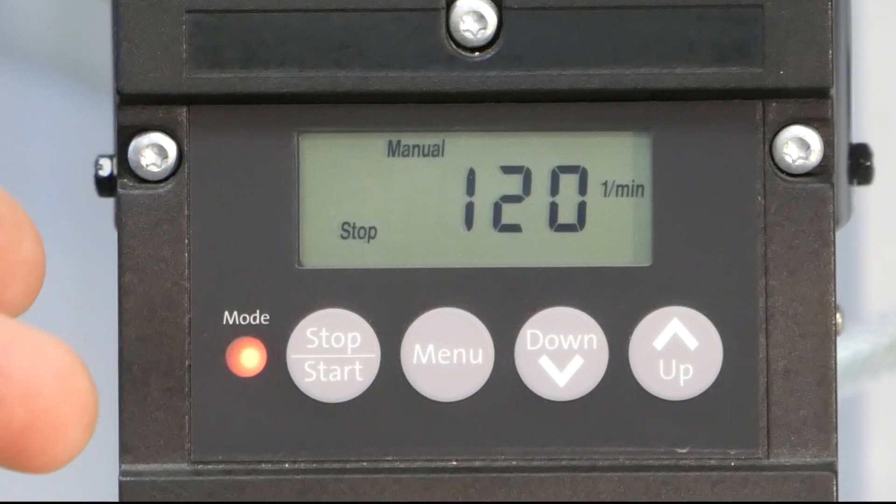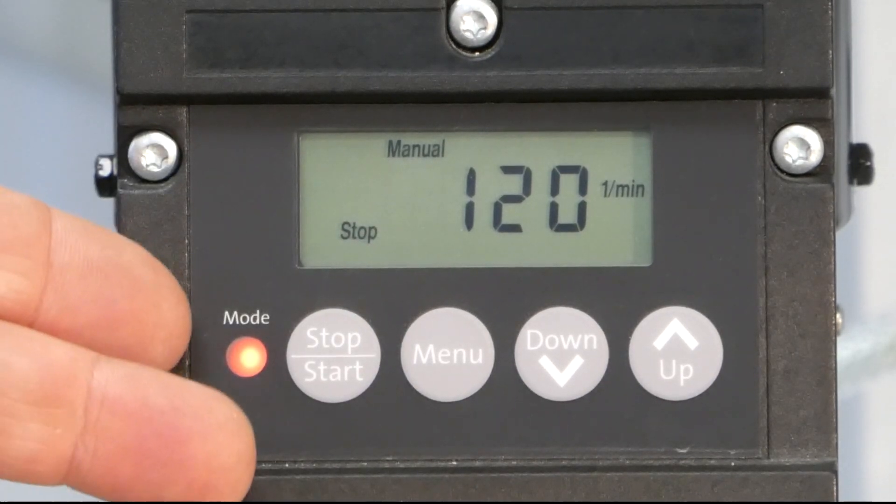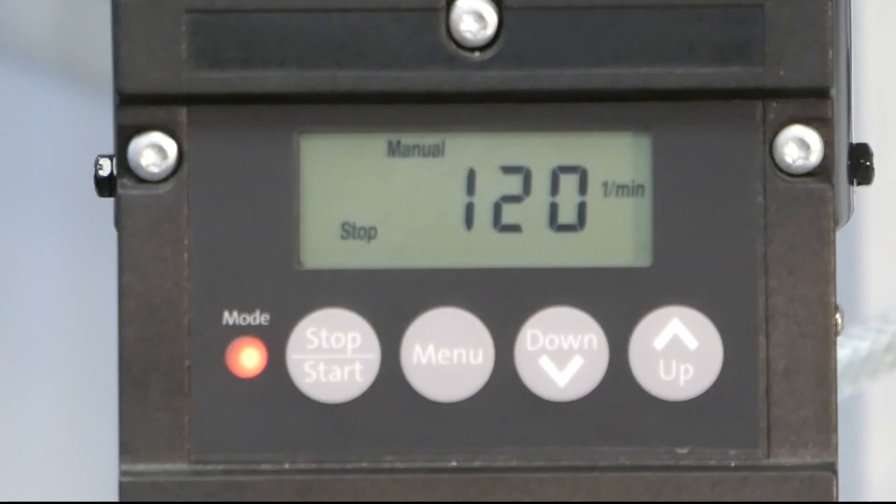There is a third color — it's orange or yellow. The pump is waiting for an external signal, like a pulse input or an analog input, and is waiting to operate soon. On the display, you can also see the status — here, actually, you can see a stop is indicated, which fits the red LED.